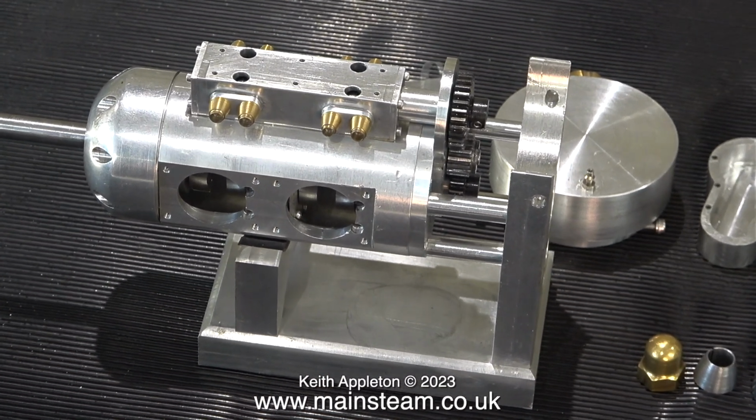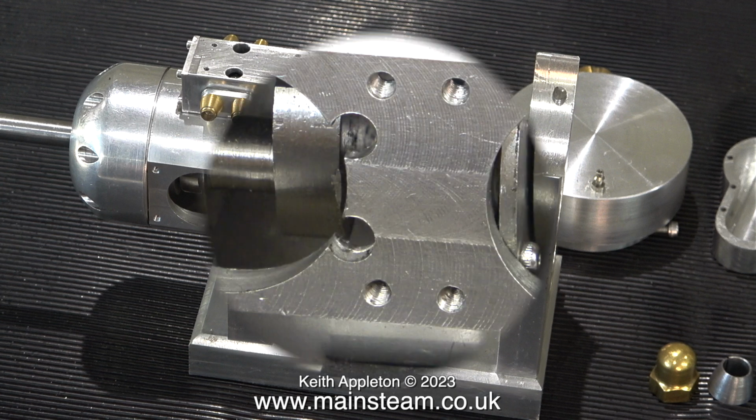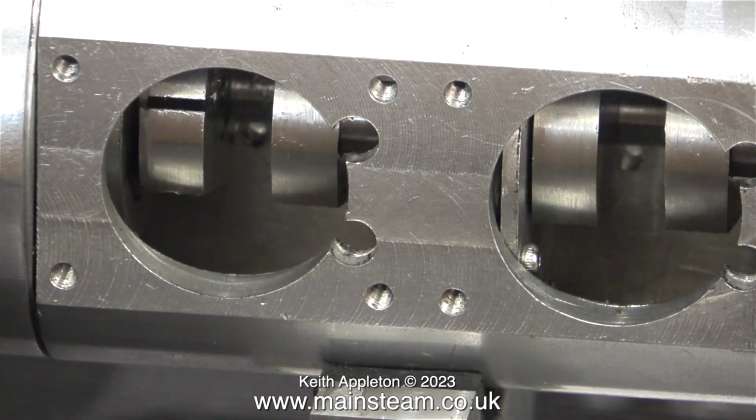A 4-cylinder. It's a 4-stroke internal combustion engine with 4 cylinders, and to make it look right, every cylinder has to look identical. Andrew also cuts his own gears. The gears on this engine are not commercially bought items. And the crankshaft inside this engine, which I will show again later, is a work of art, if you analyse how it's made and how it fits together.